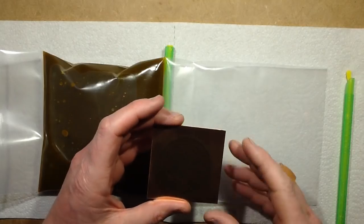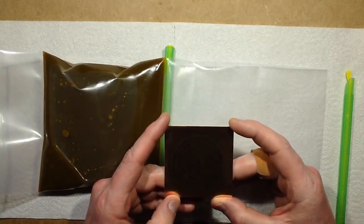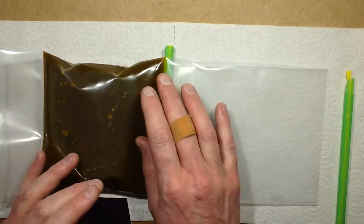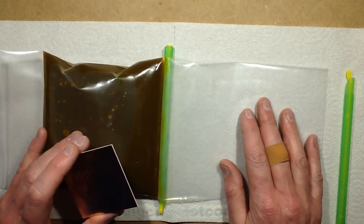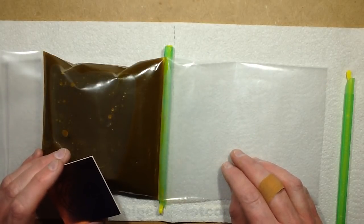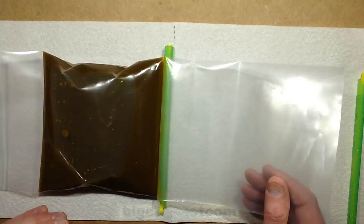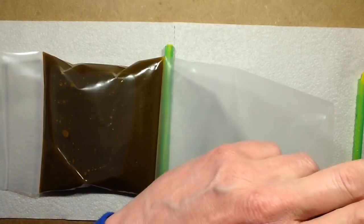Well, I've now exposed and developed the circuit board using my preferred developing solution, which is sodium metasilicate in a ratio of 12 grams of sodium metasilicate in 250 millilitres of water. And now this is kind of like my Sino GS etch system, but this is one I had to improvise myself because I really messed up the other one. I tried to give it a little zap in the microwave to warm it up, and unfortunately it damaged the plastic. So this is a dodgy experimental version that I've made with some heat seal tubing, and I'm going to give it a go.